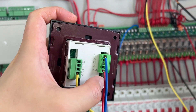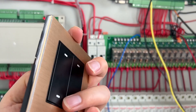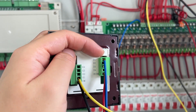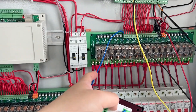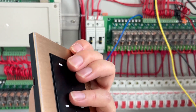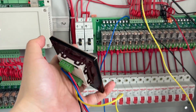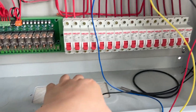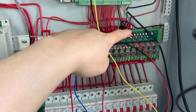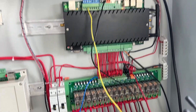You can see that DCOM — this DCOM, the red cable — is from this 12V. So if you want this LED on, we need to give 0V; just ground will be on, and the 12V will be off. So this D1, I use this blue line and get the voltage from this MOSFET output. When this cable has 0V, the LED will be on. When this cable has 12V, the LED will be off. So this is the principle. I just use this small module. This is input — this cable is the power input. And this black is also from this ground.